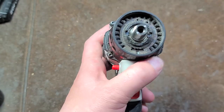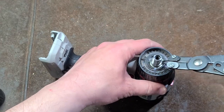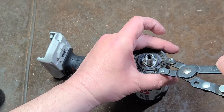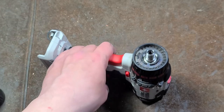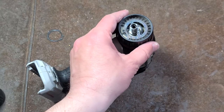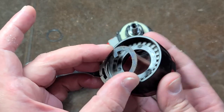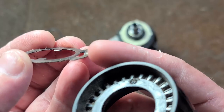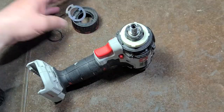We do have a snap ring here holding on this front collar for the clutch. We'll use these funky old Craftsman snap ring pliers to get it off. You want to remember to keep your hands over or around the snap ring so that if it slips off and shoots off, it won't hit you in the eye. It's also advisable to wear safety goggles. Here's our clutch ring and another steel collar. When you do the clutch and it makes clicking sounds, this little collar has a little bump that rides in those slots — that's what's providing the clicks.